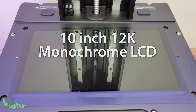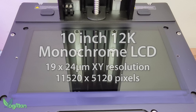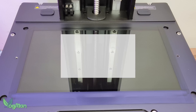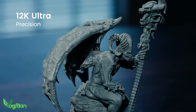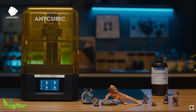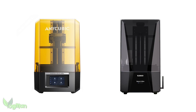The 12K screen is what it's really all about, and just like Anycubic, it's a 19x24 micron XY resolution light source, so again we're going to have rectangular rather than square pixels. This makes me think it's exactly the same screen as we find on the M5S, no doubt bought from the same supplier. Who cares about rectangular pixels? I saw good prints on the M5S and you'll also see them here — but it was whilst comparing these 12K prints that I noticed something strange.